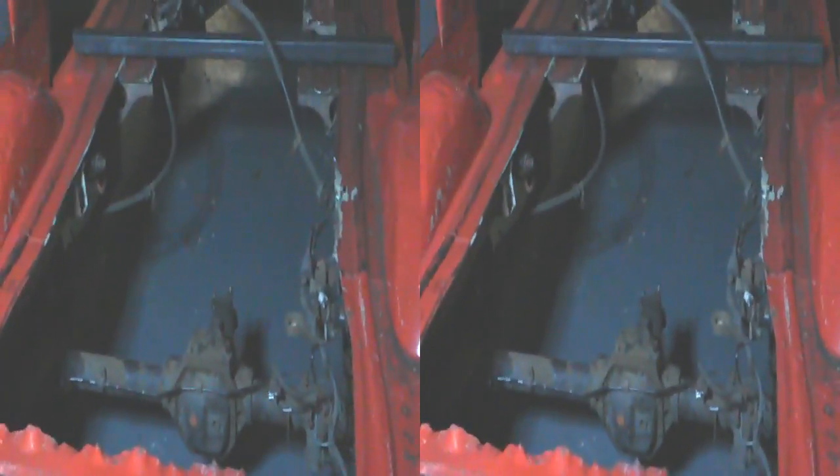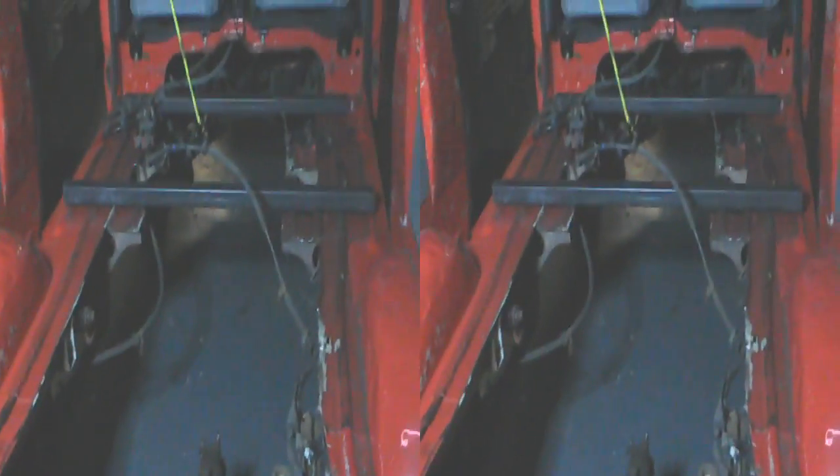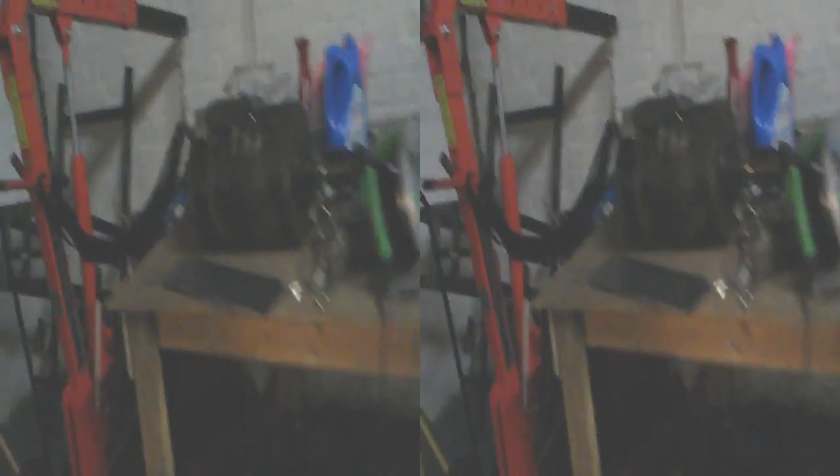I've done some rough testing to see about the strength, and I'm quite reasonably convinced that you'll need quite a considerable amount of torque before you actually bend these plates, because the weight of the motor on them is stretching them. We're talking a couple of hundred kilos, so they're in tension anyway. It'll have to overcome the tension, plus obviously it'll actually be twisting, so it'll be not just lifting it but twisting it. I think you've got a considerable amount of power there.